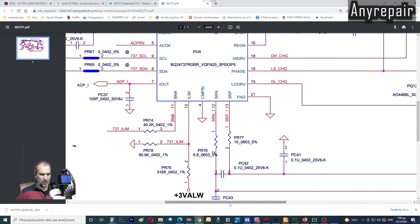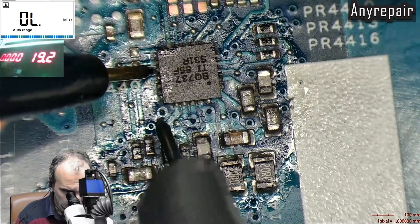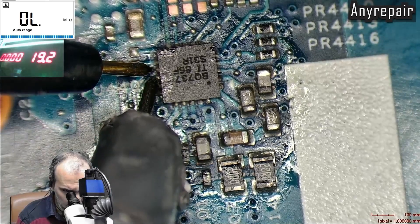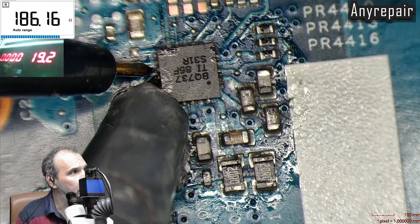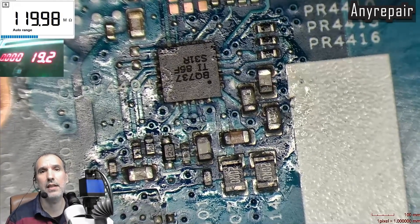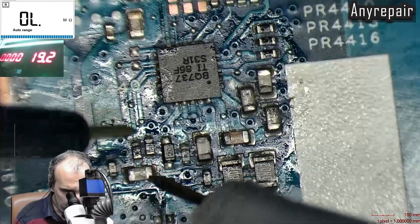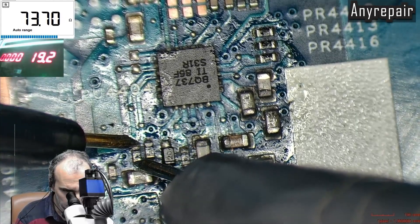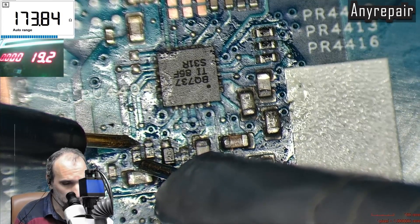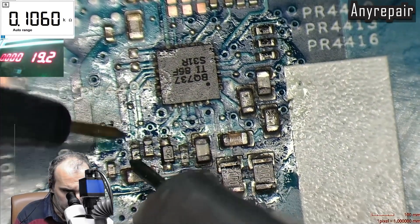We will check the pins at the microscope in ohm scale. The resistance is very high — 188 ohms is a very high value for these lines. Let's check the resistor connected to pin 12: it reads 170 ohms. The pin 13 resistor has a value of 10.5 ohms, which is OK.